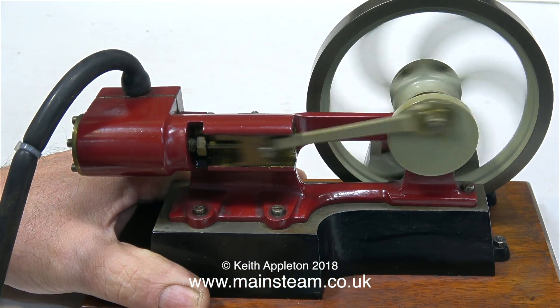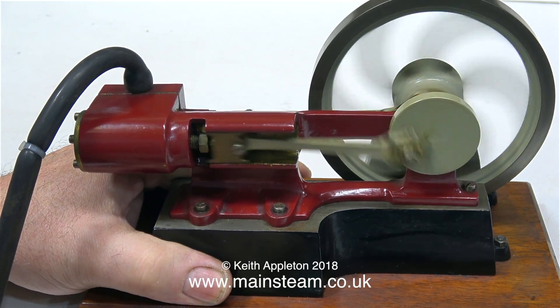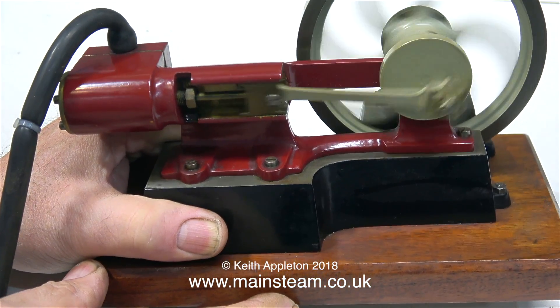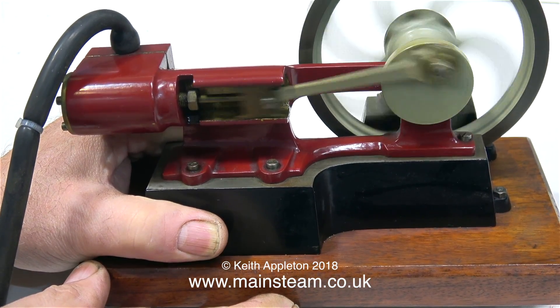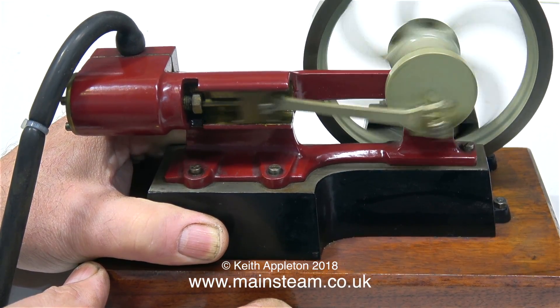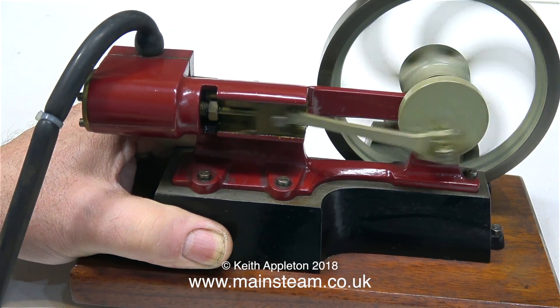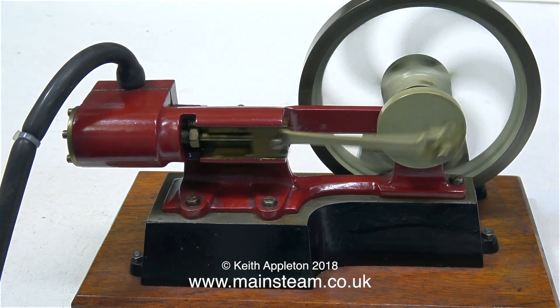If you listen beyond the clunking noise, the beats are quite even at each end of the cylinder. And if I lift the engine off the soundboard, you can hear that the exhaust beats are quite even. These small Tangy engines use a slightly different method to set the valve timing — the eccentric is part of the flywheel, so all you have to do is rotate the flywheel slightly relative to the crankpin.